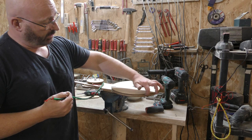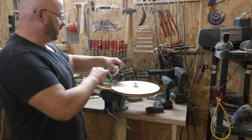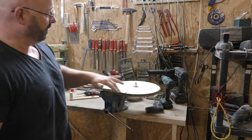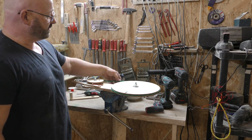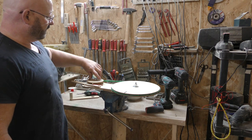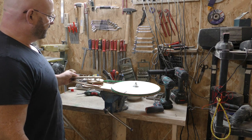It actually has a polished rim here so that the rubber is not damaged. This wheel takes about 100 centimeters of rubber. And again, this is now slightly pre-stretched — you can already see that it is pre-stretched. And now when I start turning, I'm spooling this up, and I can actually do this about seven windings.